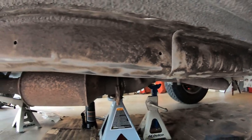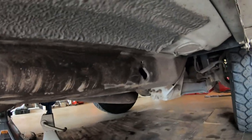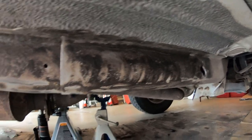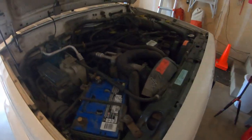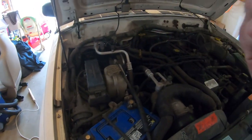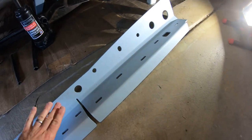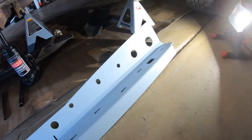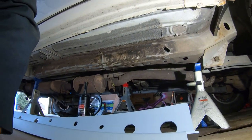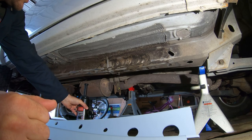Here is the passenger side, and most of the undercoating has been cleaned off and smoothed out a little bit. Right now I'm going to finish cleaning everything up on this side, test fit it, and then mark where all the specific weld spots need to be scraped off. Then we'll do the weld-through primer — the one I'm using is from SEM, zinc weld-through primer. Here is the passenger side center section frame stiffener with that gray zinc primer coating. We're going to mock this up and I have the bottle jack here so we can bend it into shape and get everything lined up.